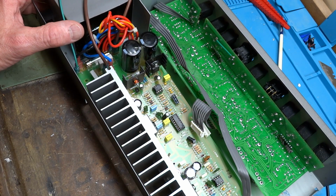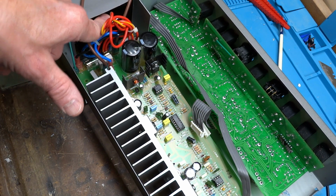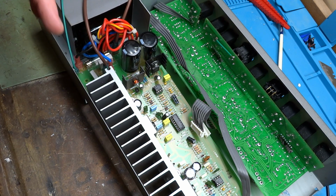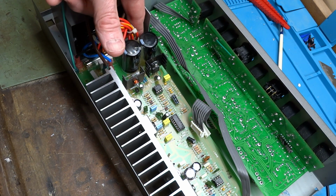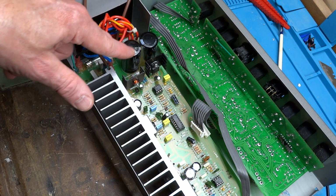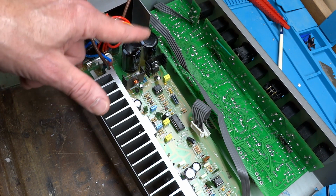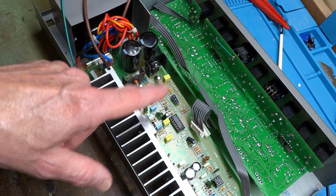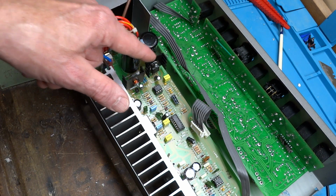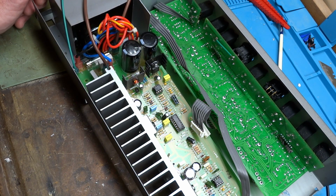Now here's a bird's eye view of the innards, and a quick rundown for those of you who wouldn't be familiar. Got a transformer here, steps it down from 120 volts down to, schematic doesn't say, so I'm just going to guess maybe 15, 18 volts AC. Then that AC power goes into this rectifier that I thought might have been the problem. That converts it to DC. Long story short, it goes then into these two capacitors to clean up the voltage a little bit, remove what's called ripple. Then coming off of there is, if I remember right, 20 volts, a 20 volt negative, 20 volt positive rail. That powers the higher power things like your output transistors. Then from there, it goes into these two components, and those are your voltage regulators for 15 volts.